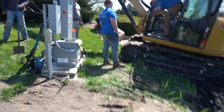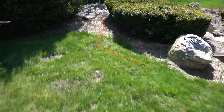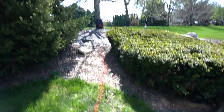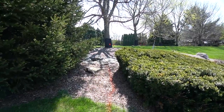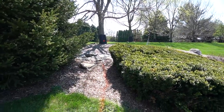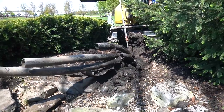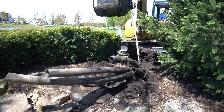We're going to come in with new six-inch pipe that's going to come right through here — you can see we have a mark on the ground. We'll pull off that large stone over there, make a way for that piping system to go into the upper area, and then bring it back down and around to connect everything up. Here's our old piping — we're going to try to pull that back so we can make the trench.